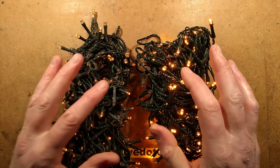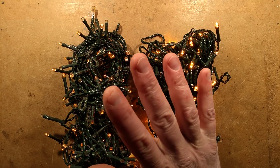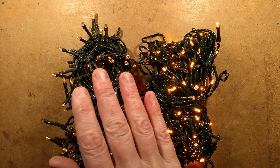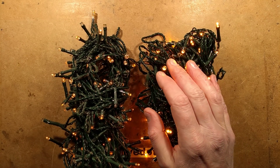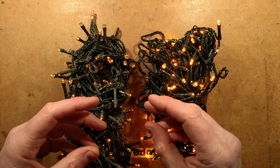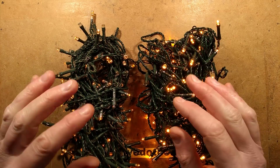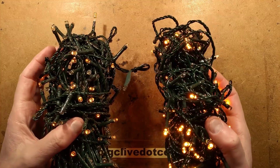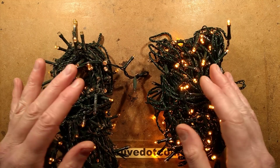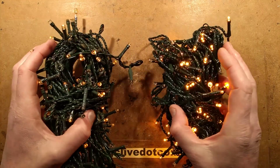After the season I noticed it just did not look as bright. I checked the control system — everything was set at full intensity. When we took it down I cut a meter off the spare slack, re-terminated it, and put it next to brand new stock. The difference in intensity over just one Christmas season — literally weeks — was stark: really bright new, really dull old. The supplier did replace it all for free, though ultimately it was going to lose brightness again.